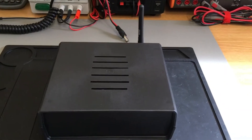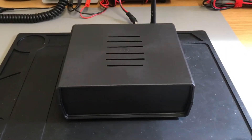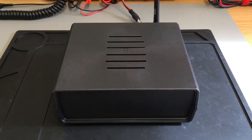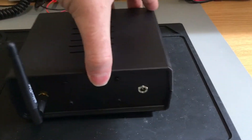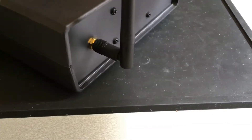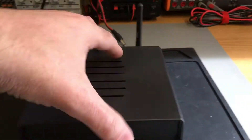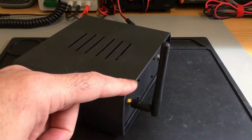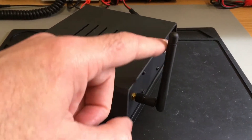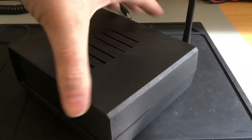I'm going to put together a little video on one of my projects. This is an ADS-B radar beacon for aircraft. It's got a little stubby antenna on the back, nothing on the front — no display needed. Around the back there is an aerial operating at 1090 megahertz, which is just over one gigahertz. That's the frequency aircraft radar uses in Western Europe. In America it's 978 megahertz. That antenna and a power input is all you need.